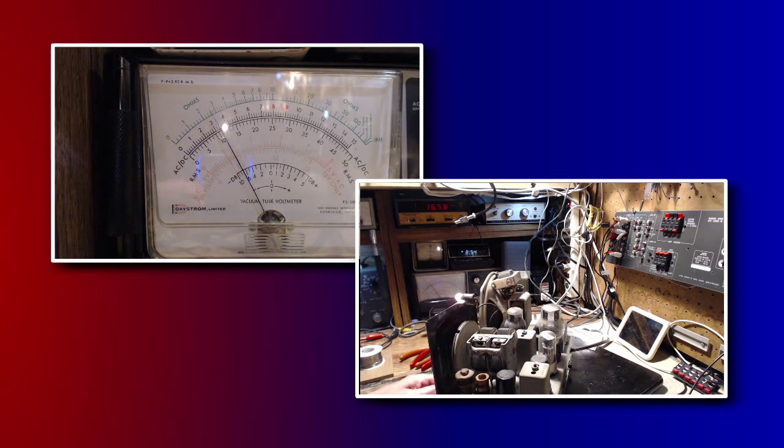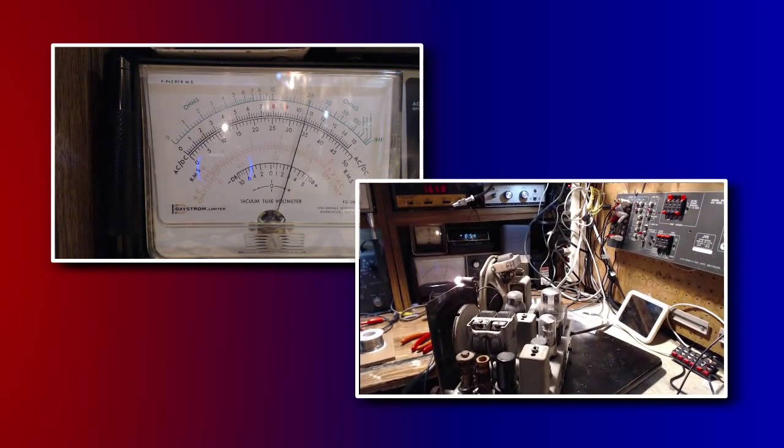With the AVC, back to shortwave. AVC voltage shows up and quiets the radio. What is doing that? You know what? I've got all these 6SA7 tubes sitting here. Just on a whim, let's change the 6SA7. Just see if that doesn't fix this. Can't imagine how, but it's too easy. Got to do it. Okay, so I shut the power off.